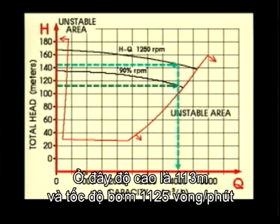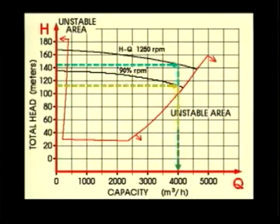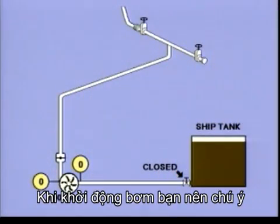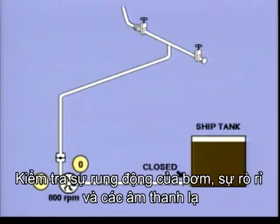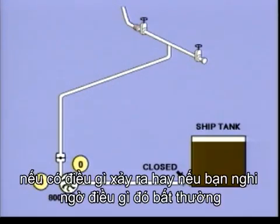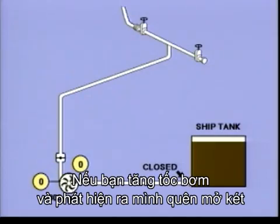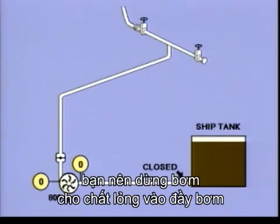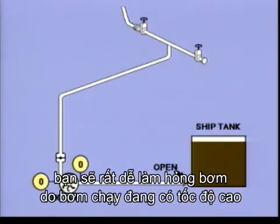Here, the head is 113 metres and the speed is 1,125 revolutions. You will consume less bunker if you can run the pump at slower speed and still discharge at full rate, so do this whenever possible. When you start the pumps, you should really be on your toes. Have people watch out for leaks in the pump room and on deck. Check the pumps for vibrations, leaks and abnormal sounds. If something should happen or if you think something is going wrong, don't hesitate to reduce speed or stop the pumps. If you speed up a pump and find you've forgotten to open the tank, stop the pump, fill the pump with liquid, then start the pump again. Just opening to the tank will most likely totally wreck a speeding pump.